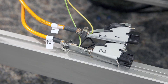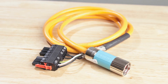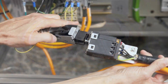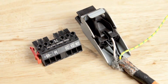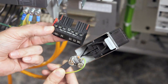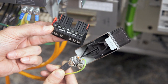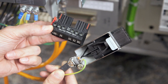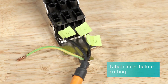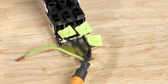The next thing we have to do is connect the motor to the new C/D type motor module. You could replace the whole cable, but this may not be practical, so there are two other options. The first is to use the cable adapter that comes in a two-meter length. The second, which is the most popular, is to just take off the old connector and assemble a new one. To use this option, you'll need to make sure you have a couple of inches of extra cable. The motors used here do not have a brake, so I didn't have to wire any brake wires. Before I cut or disconnect any of the motor wires, I want to make sure I label them U, V, and W. U-phase is always towards the front, but it's important we don't get them mixed up.